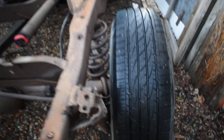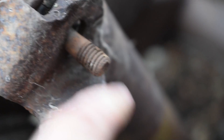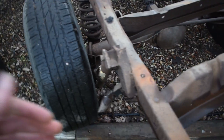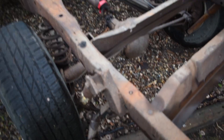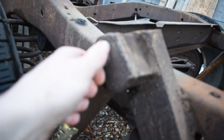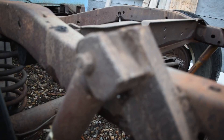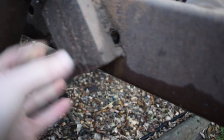The shock mount has been welded and is on the verge of cracking - it's pretty bad and needs to be replaced. There's no nut on this shock at all. It was actually riding loose and has worn the threads completely smooth off the bolt. Moving over to the other side, that one is made out of square steel - probably whatever was laying around the farm. At least that one has a nut on it, but it'll probably need replacing too.